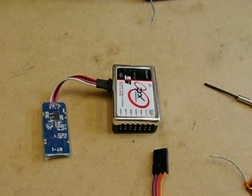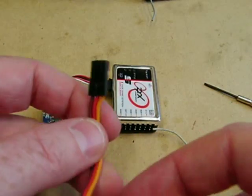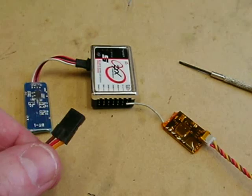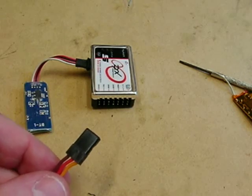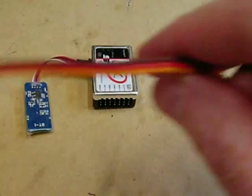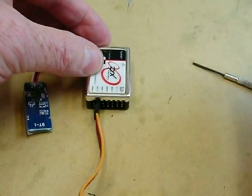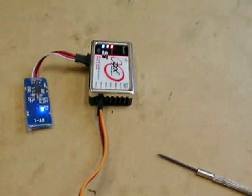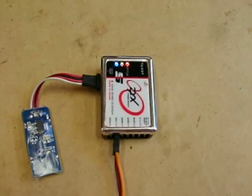So we're going to prepare to get that ready for binding. This is just a power lead, six volts, coming from an ESC connected to a helicopter and a motor. The reason I've done that is so you can hear whether the ESC is accepting the signal or whether it's complaining. First, connect just your power lead into channel one — negative down — into channel one. We're going to power up the ESC. You've got three lights here; that's my ESC complaining. I've just got three straight lights on the Tarot.